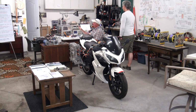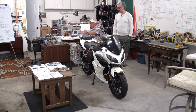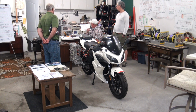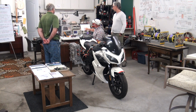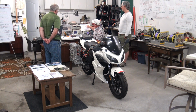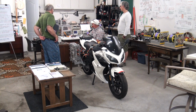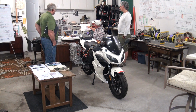So, same scenario with this as with this. We bring the system up to rotational equilibrium. You can actually squeeze in here, and you're welcome to come closer if you want. So this one is drawing 75 watts right now? It's gonna drop once. So right now we're going up here. And then it's going to start to head down towards here. So what we want to make sure is we're operating in this region, not this region.